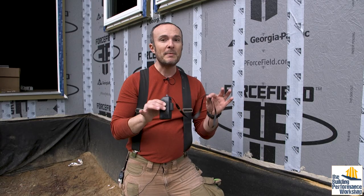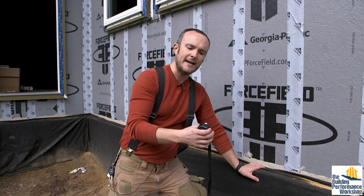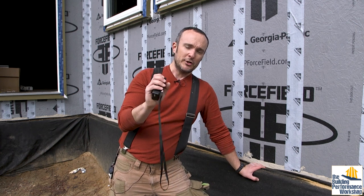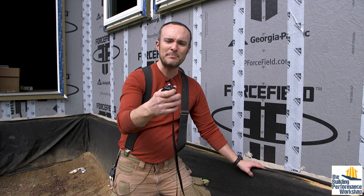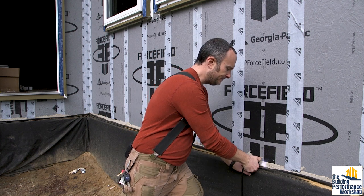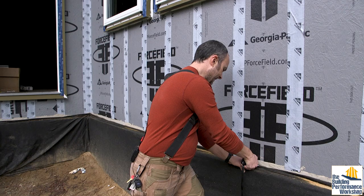So what we have now is — tools are our friend. By the way, all the tools that you're seeing in this video I got from True Tech Tools. They care about tools, so please do get your tools there and not from Amazon or something like that. This is something that they showed me, which is a great alternative to the dragon puffer that many of you might use — that looks like a toy, it's a big blue silly looking thing that gets your hands all sticky and slimy. Also a great alternative to titanium tetrachloride, which is the really dangerous stuff for electronics — don't store it near electronics. That's the big red tube that has smoke that comes out of it; that smoke is hydrochloric acid when it hits air, so not really nice stuff. This is just simple glycol. It's got a light built into it, which is kind of neat, and you just warm it up. It's basically a theatrical fogger but just for your hand. It's called the Cirrus from True Tech Tools. We want to just puff down here and see if it's getting drawn in. Even though I've got wind out here, I can see pretty clearly that it is being sucked on from below.